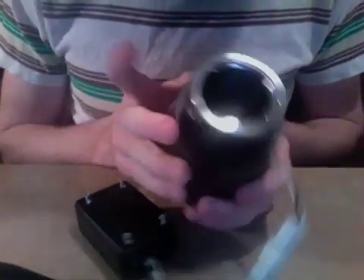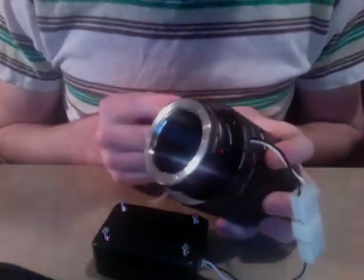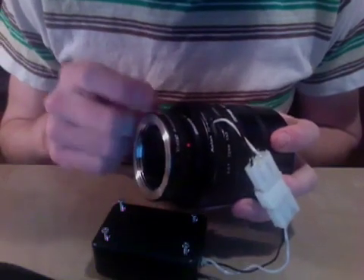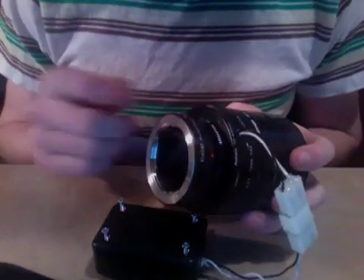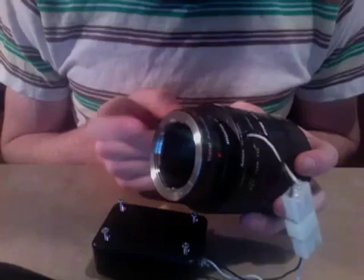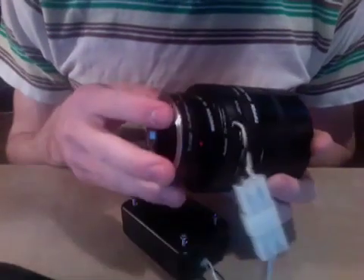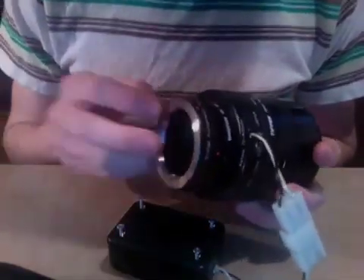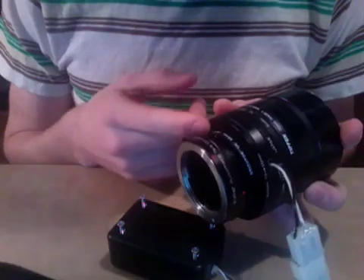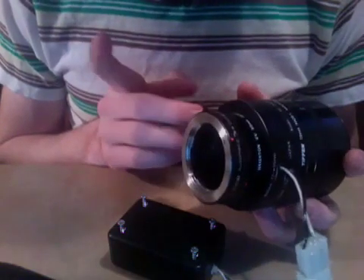So that's your system. This bayonet is from an Alta lens — I know you can get Nikon, Canon, anything pretty much. The challenge for you will be figuring out a way to attach this to a 72 millimeter thing. I know they sell Asian extension tubes, and the guy who sells the GG holders also makes GG holders to go into those extension tubes, so that makes it easier. But for my sake, this is how I did it. If you want, you can buy these teleconverters, disassemble everything except for the front piece, and attach the 55 millimeter UV glass fairly easily with some gorilla glue.